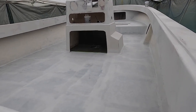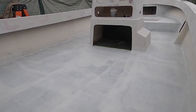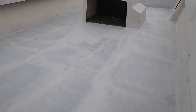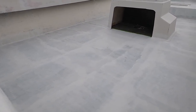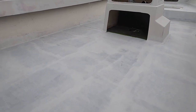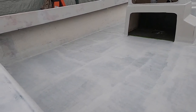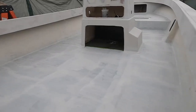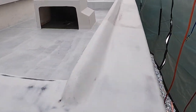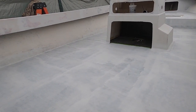We got the second coat of primer down and it's looking a lot better. Still some unevenness where I overlapped with the roller — that just comes with time and experience. There's a deep-mounted spot in a low traffic area. I have no doubt now that when I put the white paint on it's going to really brighten everything up nicely. Gunnels are looking right — I think I'm just going to sand them down and paint them as well because I am done rolling primer. Took about an hour and a half with that 4-inch mohair roller — it's like cutting a golf course with a push mower.